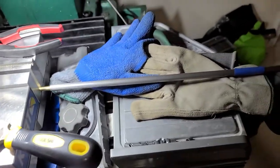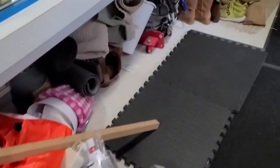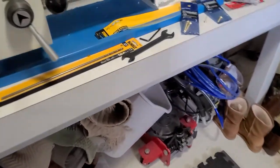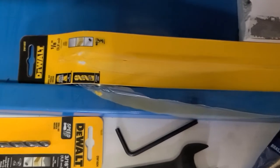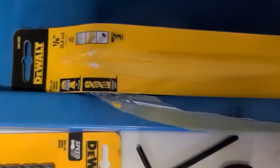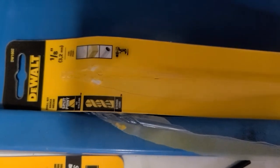Dave and I tried to pound them out with a hammer and a steel rod, and believe it or not we spent three hours doing it — it did not work. If we were good at physics we would know that when you pound lead it expands and it basically glued itself to the side of the barrel sleeve, making it even more difficult to remove.